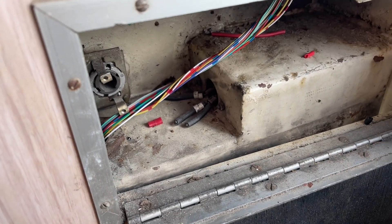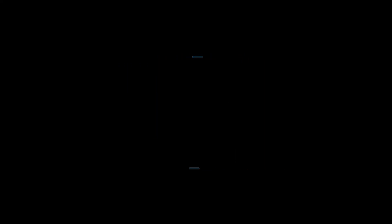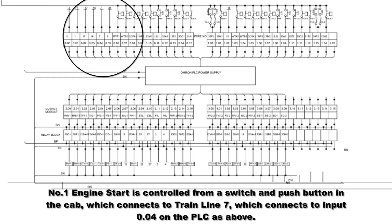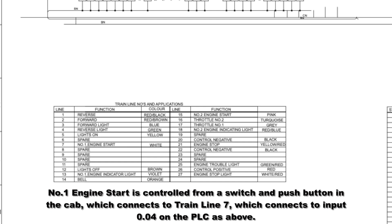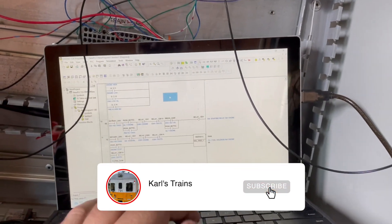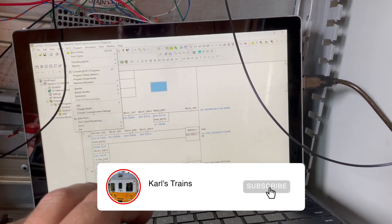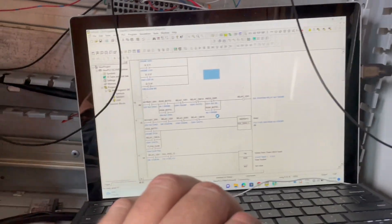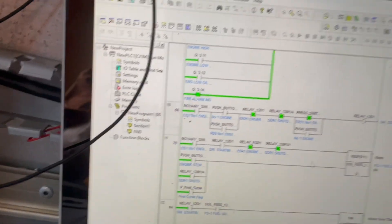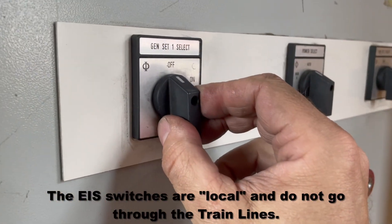We've got to take out the different wire colours for the different things, hook them up, and then we'll have some lights and some control cab wiring up and running. A week later, we're doing a simulated engine start. The engine start number one engine comes into train line seven — let's see how it works. We've got a bit more wiring done, a little bit messy, but we've got all our train line wiring into the cab. Some of the lights are working. I've got John standing in the cab. Let's connect up to the PLC. We can see engine isolating switch number one is now in place and connected. We're using this old panel from ML70.